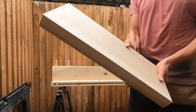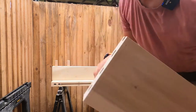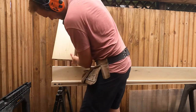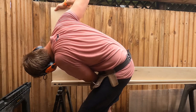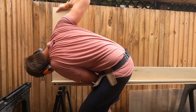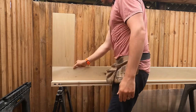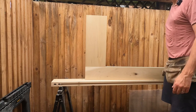Now we've got the base. You've just got to line up the face lines like I showed you earlier so they all line up — in this case it's on the other side. Make sure the groove also follows this channel, and just line up the dominoes and give it a push home. There you go — you can see there, that was a beautiful fit.